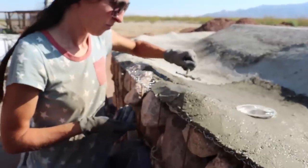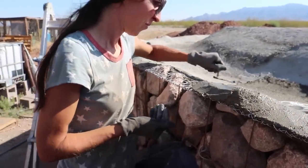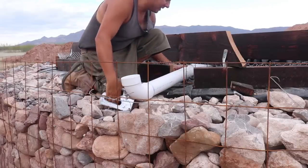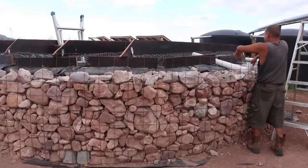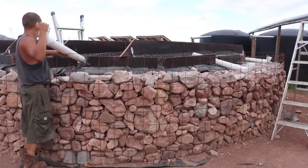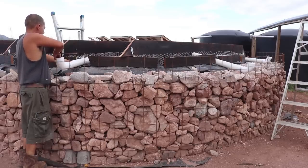Part of the roof is connected to the gutters, which are also ferro cement. We stuck pipes right in there to drain into the cistern — basically five elbows and five lengths of PVC draining from the gutter into the cistern. That was about $20.